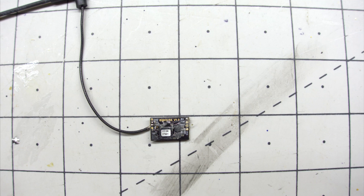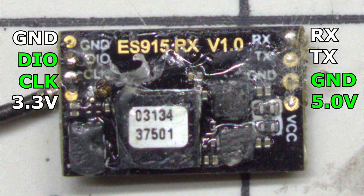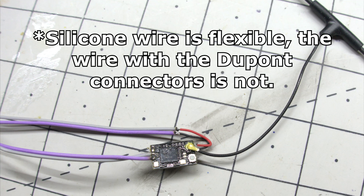After removing the receiver from my quad, we start off on the bench. The receiver first needs some leads. We solder on some DuPont connectors to our receiver so that we can plug it into our ST-Link. We solder to ground, 5V in, clock, and DIO. I use some silicone wires for two of the connectors to avoid putting any undue stress on the pads. The pads are small and I didn't want to wreck the receiver.